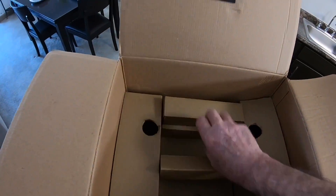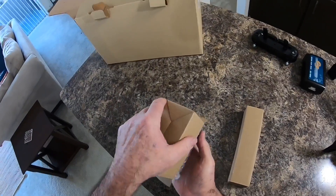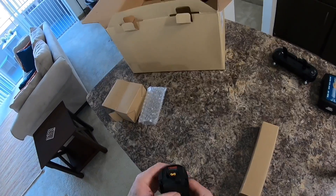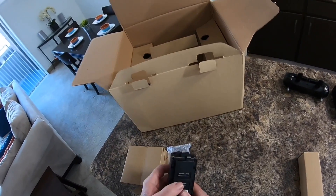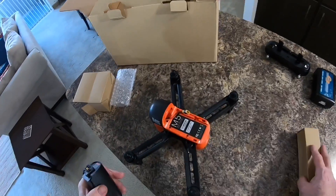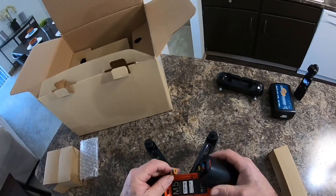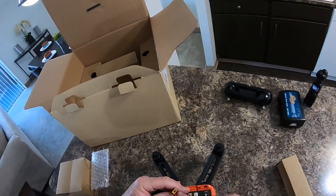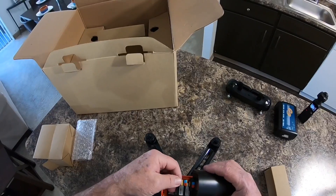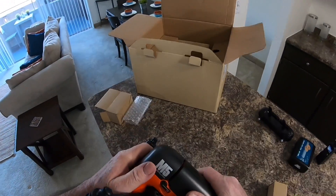That's two boxes down. Let's get the last ones out - oh, this is the battery. It's a nice healthy-looking battery - not swollen or anything, so it's a good one. It's a 1850mAh, 14.8 volt. They claim like 18 minutes of flight time, but you know how flight time stuff is exaggerated. Here's the connector to hook it up to the quadcopter. It's got a curved JST connector - curved on one side and flat on the other - so you can't put it on backwards, but they label it for you anyway. Double idiot protection.